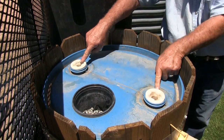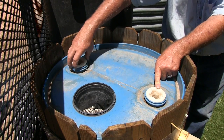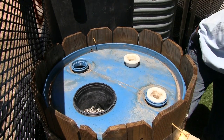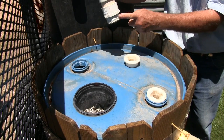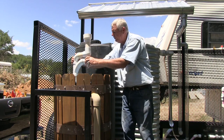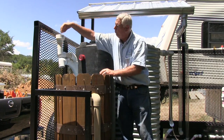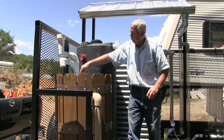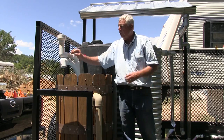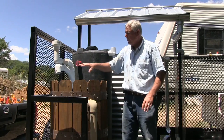As an option, most of these will have two-inch fittings or bung holes in here. I can take out the one with very fine threads and insert a tubing or pipe that has the same threads — a two-inch — and thread it on. This is a way that I can catch water from the house, with water coming straight from my downspout falling right into here, then running into my rain barrel. As it fills up, this would be my overflow, or it could be turned to the side to go to my next rain barrel. I can connect several of those together with this process.